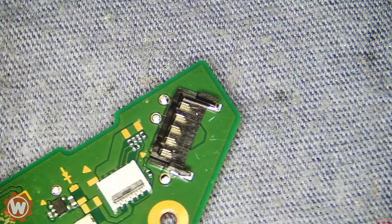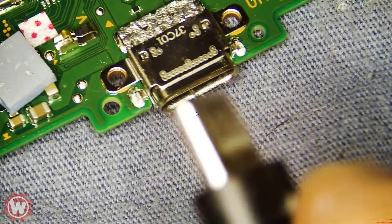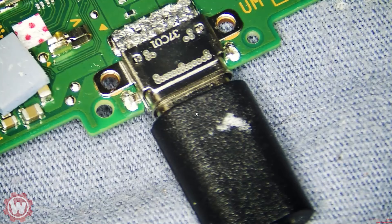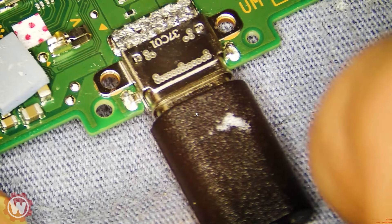Let's plug the battery in and see what activity we get. Depending on the amps it's drawing I'll know if it boots or if there are issues. We're getting 37 — that's very good — 37 milliamps. Then zero, and now it's booting: we're getting 0.56 amps without the screen. With the screen you'd get about 0.99 to 1.25. It looks like it's working — that's very good. Let's remove the battery.